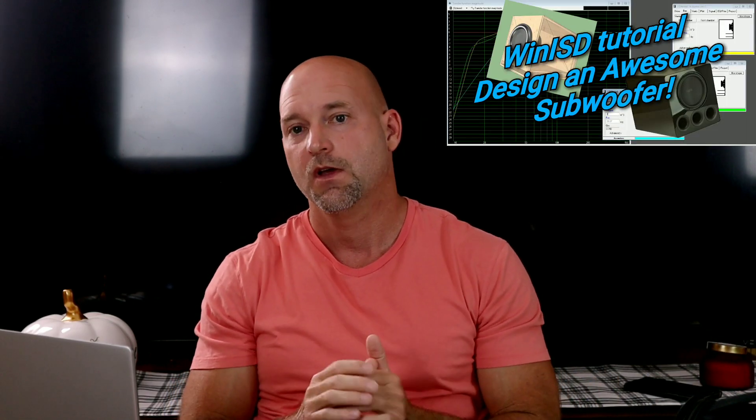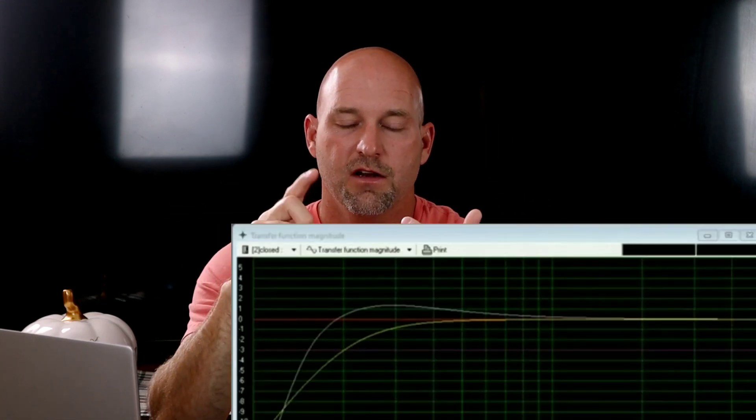Look down in the description — I'll link the performance video for the Hammer. So let's get on to why we need a high pass filter. If you remember when we designed the Hammer back in the WinISD tutorial episode — that's where the Hammer was kind of born — we looked at things that happen above and below tuning. Above tuning, we're controlling that cone and the driver using the volume of the enclosure and by manipulating the port. But below tuning, all hell breaks loose. We have no control — the cone loses control, there's nothing there to control it. It's flapping around like a fish.